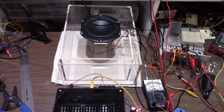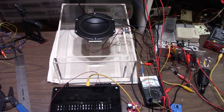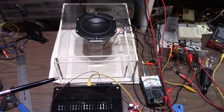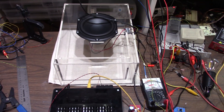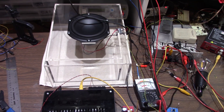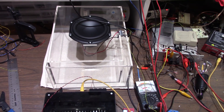I'm going to wrap it up here. As far as the port noise goes — when you hook up a small speaker and play pure sine wave tones through it, you're always going to hear something, it's just the way it is. If you ever listen to Wilston's Audio Lab when he's recording subwoofers with ports, you can always hear the port noise, distortion, and the noise in the box that comes through the ports — it's par for the course. Normally that's going to be masked by the music you're playing. That, plus transient response, is one reason why I like sealed speakers — though you just can't get a lot of bass with a sealed system at this size. Thanks for watching.